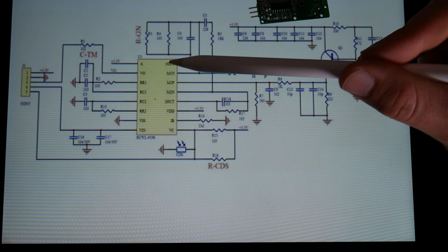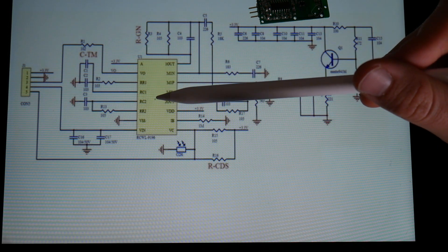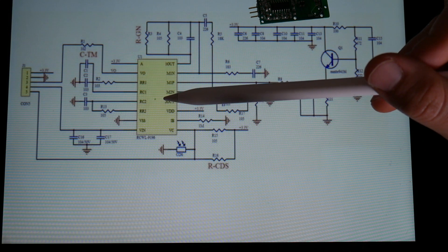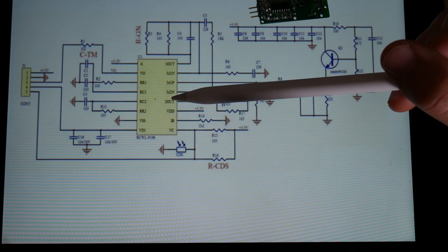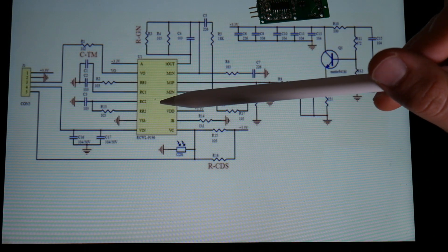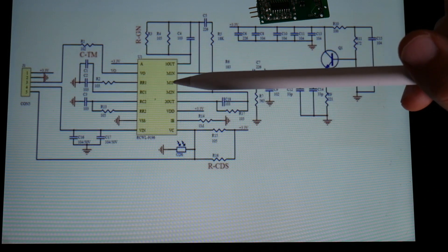That small fluctuating voltage is amplified by two operational amplifiers in the integrated circuit, and is then passed to the logic portion, which is able to detect if there have been any changes in voltage and turn on the light for a few seconds accordingly. This sensor stabilizes out, so once it is reading a constant voltage it's going to turn off the LED, and if that constant voltage changes it's going to turn it on, then turn it off once the voltage has returned to normal.